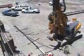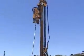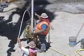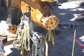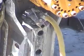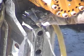A lid that could be locked and sealed was provided with an entry port for grout and an exit port for the air it displaces. A ball valve was positioned at the exit port to seal the lid and pressurize the grout at the tip of the pile and to fill the void while extracting the probe.